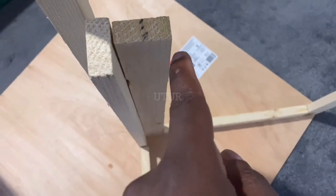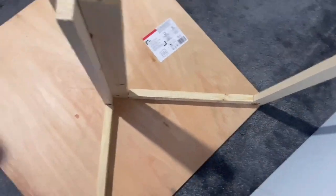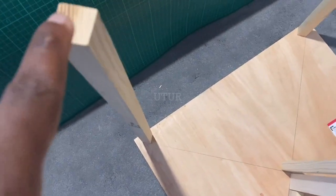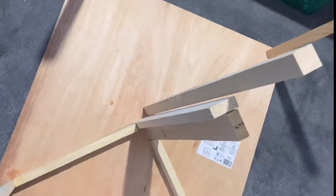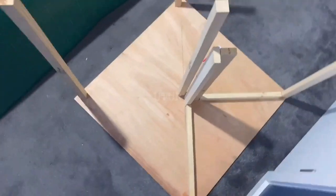If you use a larger screw, that could split the pine wood. Pilot drill first if you must, before opening up the hole to 4mm diameter. One pine wood is longer than the other in terms of height, and that's because on final assembly, when we stack each base trap on top of each other, we want all of the base traps to accumulate up to the ceiling height.